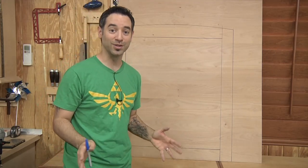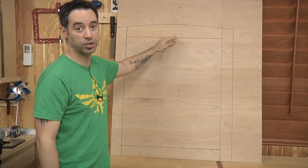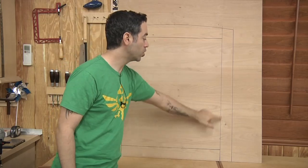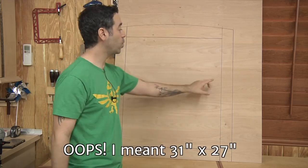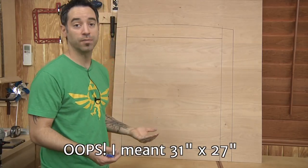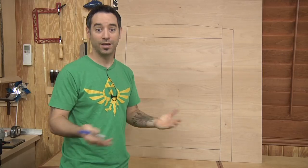We should probably think about the mirror now — we need to know what size the mirror should be cut to. I don't really mess with glass too much, so I'm going to have a local place cut it for me. I'm going with quarter-inch thick glass, so it's not going to warp or distort, and we want to cut it an inch wider and taller than the dimensions of the interior space, because we're going to cut a nice rabbet around the perimeter. For me, that's 31 and a quarter tall and 27 wide. The key is to have that glass in the shop before I finalize the internal cut on the frame.